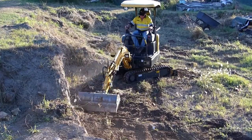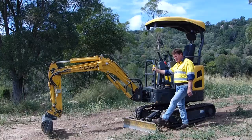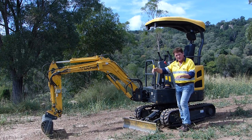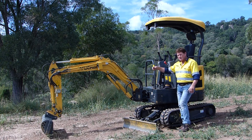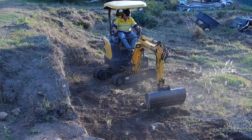I give it the thumbs up. You've got to make sure the blade's down. Dig with this to the front if you can — it'll hold your support when you want to pull in from the trench. This will sort of brace you, and it also gives you more support forward and more stability when you're swinging and tipping.